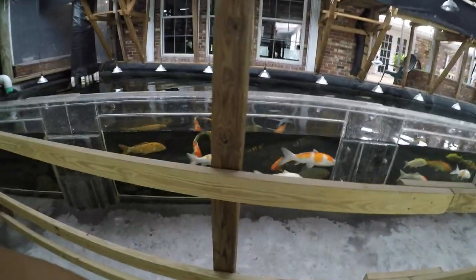The next support point is this 4x4, 3 feet in the ground. Again, the raised base. This is how they attach, the rafter is attached to the post. Same idea here, 1, 2, 3, 4, 5 3-inch screws hold up this triangular piece. That's attached to here, to there, and then with seven screws or so, it's attached to the tripled-up rafter, where I have the longest span between the super gutter and this first pole.